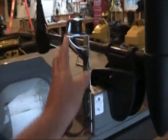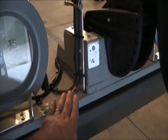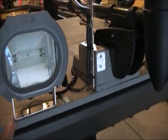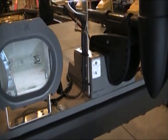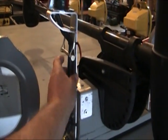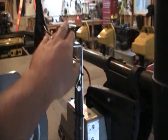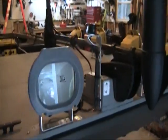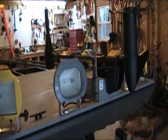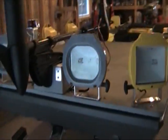Another tip: this navigation light. A lot of places will not let you have it down low — it has to be visible. If you have all these lights and the motor mount bracket and everything on the boat and you can't see the navigation light, it's not going to be legal. So I took a piece of 1.5-inch aluminum, bent it into the shape I wanted, and mounted the light on top of it so it's visible above my lights when I'm running. Those little things are what's going to save you trouble — make sure your navigation light is visible.